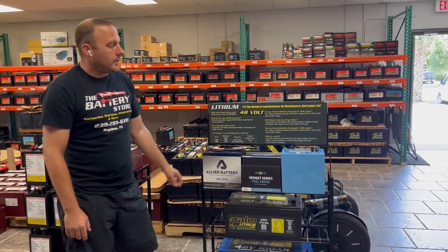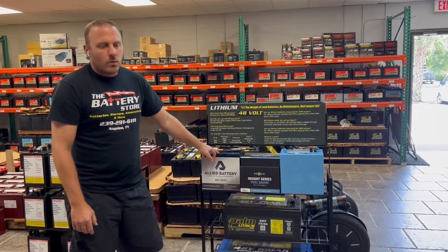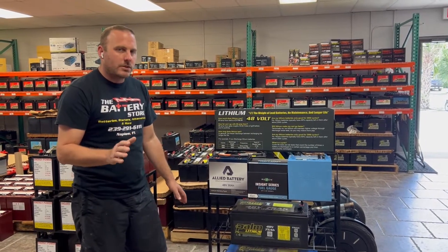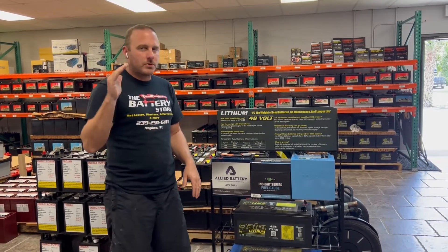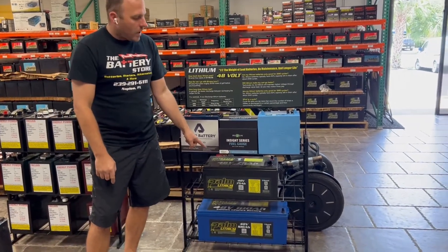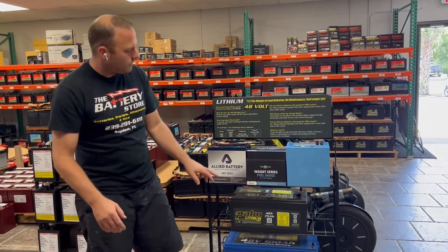The reason we need to know is because the drop-in modular batteries are 30 amp hours each, and you need two of them — that's why we say starting at 60 amp hours. These batteries discharge roughly 45 amps continuous and surge to 70 amps, so with two batteries you get about 90 amps continuous and about 140 amp surge. The mono block 75 amp-hour battery is 100 amps continuous with a 200-amp 10-to-15-second surge.